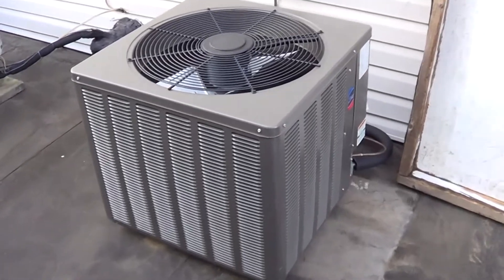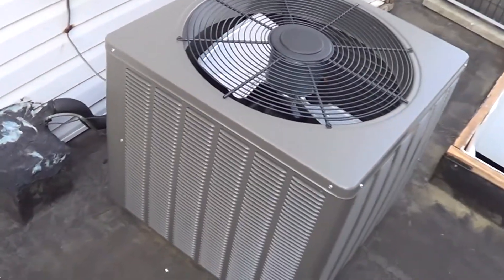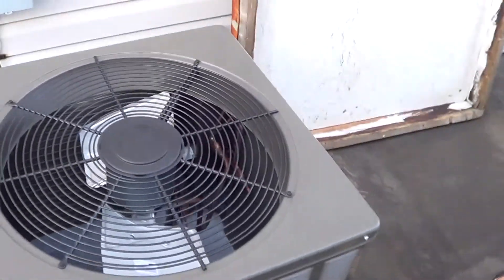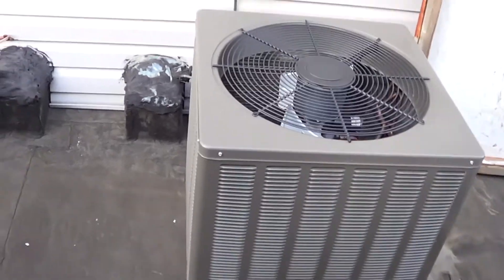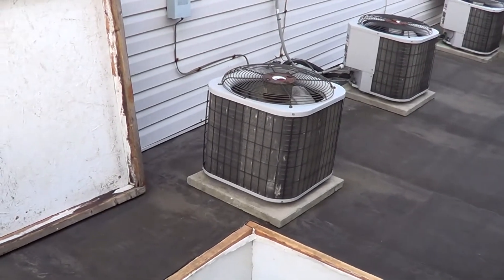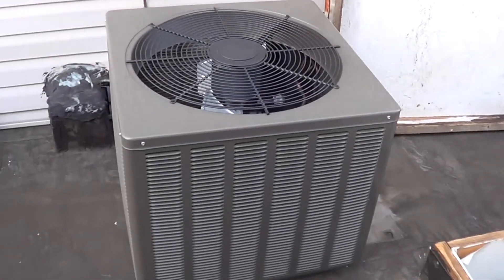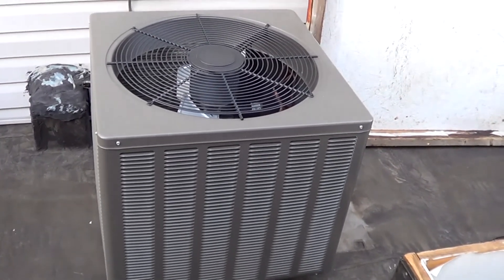The drywall turned out well and everything looks good on this system. Here's what the 3-ton unit looks like that I put in. The additional ton makes a huge difference on the loft — I was able to cool the loft because the airflow is tripled and I can dump an entire ton just for the loft. With the 13 SEER efficiency, it uses quite a bit less electricity. Here's another upstairs unit that hasn't been changed out, which is a 2-ton — going from the 2-ton to 3-ton makes all the difference in the world for keeping that loft cool for the next 20 years.